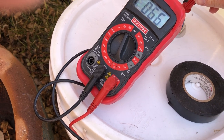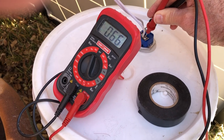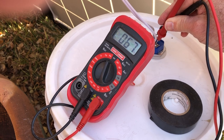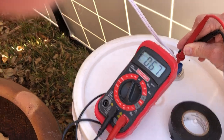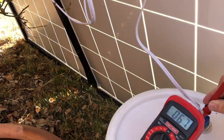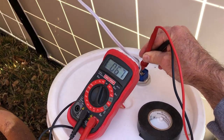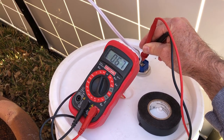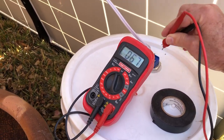I got a heating element that's got the right ohms — it's a 1500 watt heating element for 120 volts, and it's working, it's heating some water. Our idea is to make a preheater out of this. If you can get these panels at a good price, for basically 250 bucks you have something that's going to produce a bunch of heat and warm up your house water — a pretty good deal.